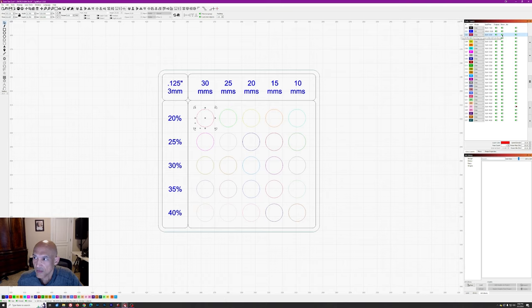This output is set and we have air assist on for this cut. As you go through — next one at 25 millimeters per second, 20% power, and so on. You have to understand how these cards are set up, because if you just load this in and hit go, there are test cards out there that are actually bad, where the row and column values don't match the settings. In that case, you're not going to be able to read them correctly.